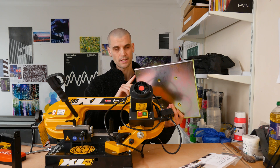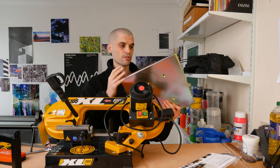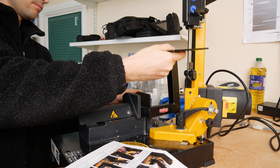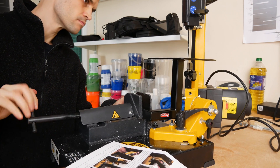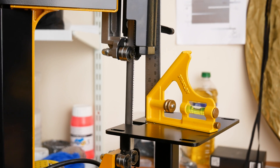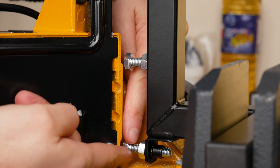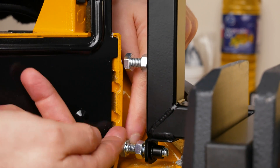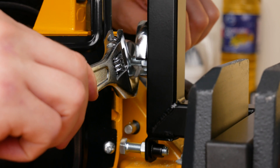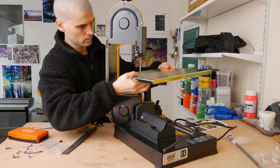When I ordered this from stakesies.co.uk I also got the Stakesies vertical table kit. We're going to install it and do some test cuts to see how it works. The table attachment was pretty easy to set up thanks to the fact that it clamps into the vice. All you need to do is get it level with the bandsaw blade using a right angle ruler, then adjust two bolts which fix the vertical position of the bandsaw, bolt in the top plate, and it's ready to go.